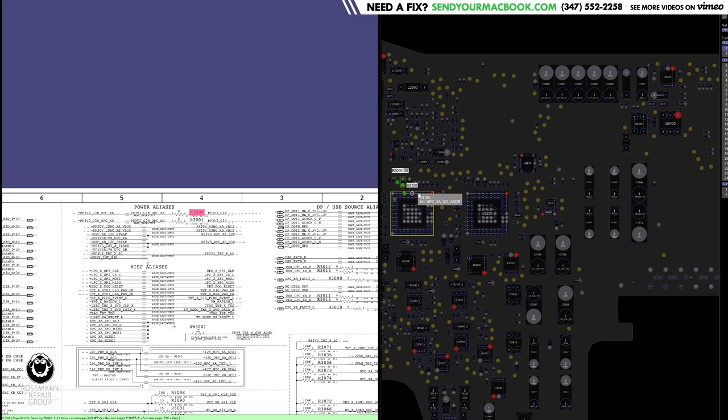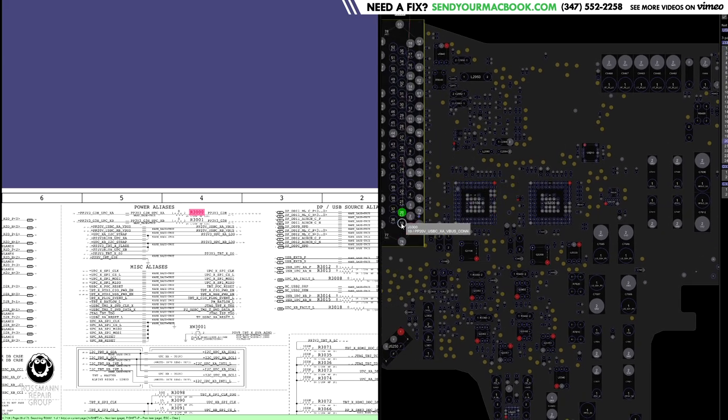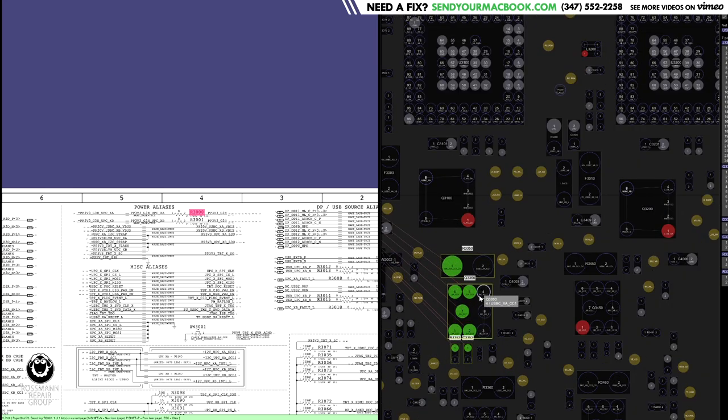That's an excellent question. The CD3215s are going to be responsible for speaking with the charger. And that's going to happen right here. So over here, you have a data line. This is this little USB-C XACC1 con. That's going to go here. That's going to go here. This little transistor goes through the transistor, and it goes to my CD3215. The CD3215 is then going to tell the charger, I am not a cell phone, I am not a GoPro, I am not a camera. I'm a MacBook, and I demand 20 volts. You will give it to me, or else. And that's what is not happening here, because it's not getting the power to do so. Now, do remember, this is a MacBook. So it would not be designed in a manner that makes sense.